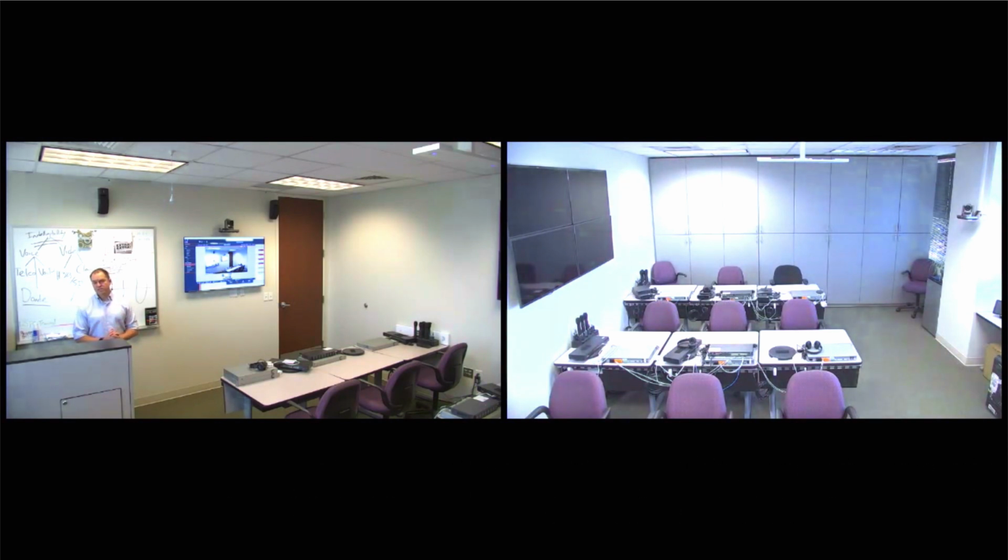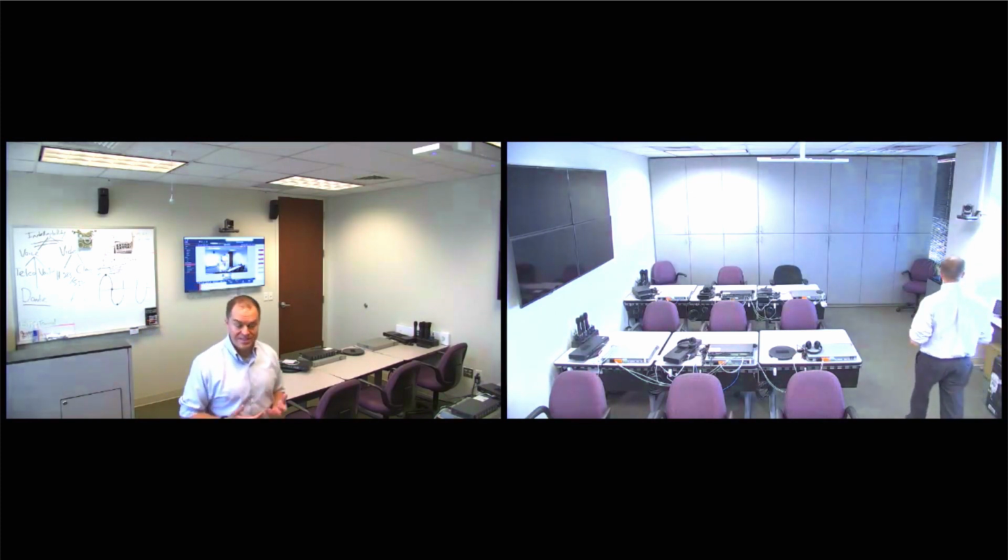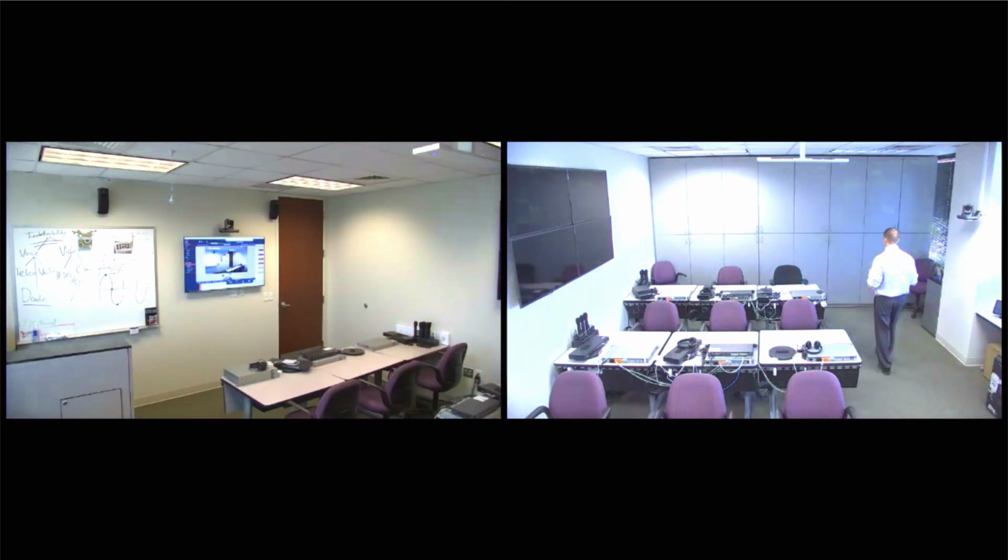What I'd like to draw your attention to is the consistent audio quality as I move through the space. So let's say that you're someone who likes to pace. You're not going to notice a significant difference in the audio quality as I move through space, whether I'm facing the beamforming microphone, or even if I go to work on the whiteboard and I'm not facing it. Now, the pickup for the beamformer is about 14 feet in a ceiling-mounted configuration, and so that's going to pick up this space very effectively.